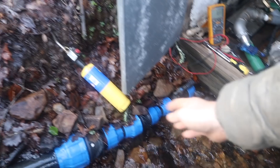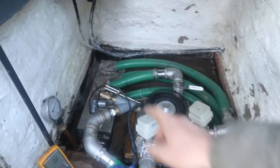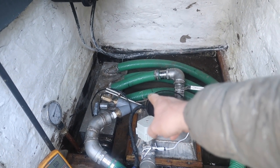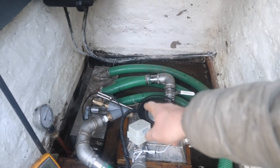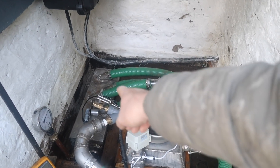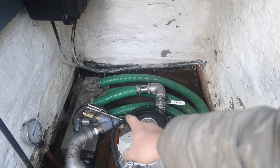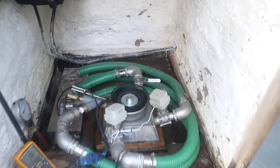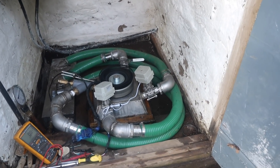The biggest gain I'll get is by making this pipe bigger, as we've discussed before. The problem is valves - the biggest ball valve I can get for this final pipe is 63mm; after that I have to use a gate valve or butterfly valve, and those introduce losses. I know another improvement I can make is the spear valve - it's sitting about 5mm too low because I had to move others up on their slots but the spear valve doesn't have a slot due to its motor mount. Once I take it apart I'll move that up - there's about five or ten watts there.